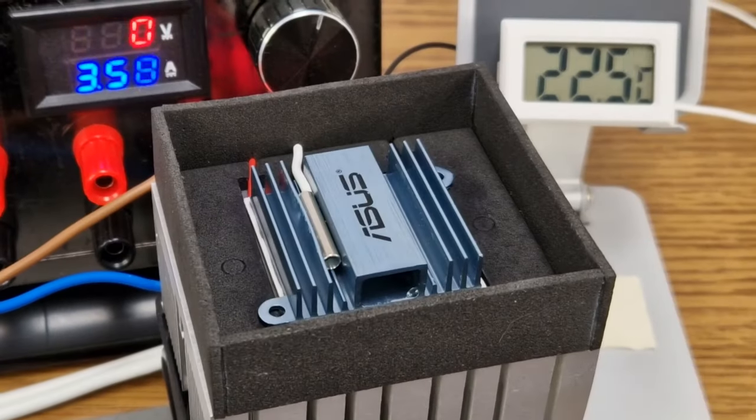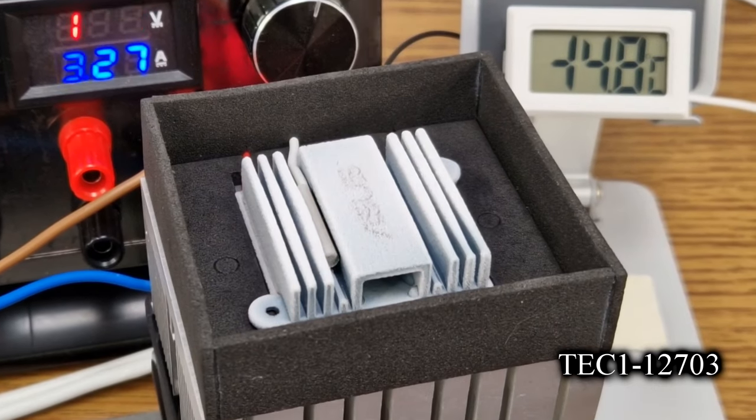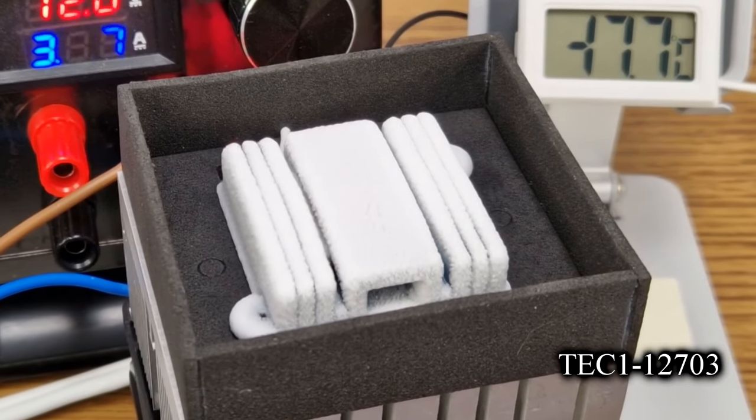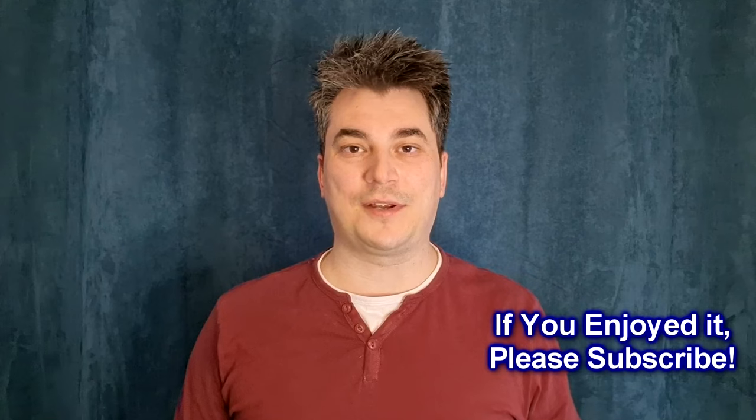I know that the 06 module is cheaper and easier to buy, but it's rubbish — it has a higher current consumption, it produces a lot of heat in the back radiator, and the cold side is actually not very cold. I like the 03 module so much that I recorded another 30 minutes of freeze time, which I compressed for you in a few seconds. So, thank you for watching this short episode. I hope it's useful for your future Peltier projects.